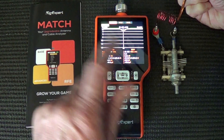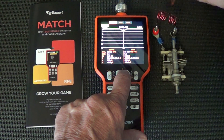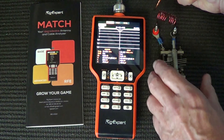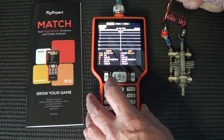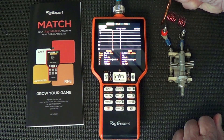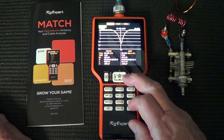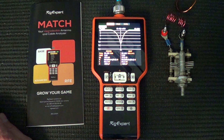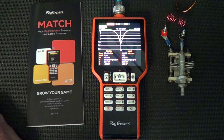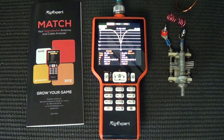Push the OK button — don't push that one because that'll go into repeat mode and writes on top of each other. Push the OK button and we'll see if we can get a good coupling. We've got a trace there, and we can see the best match is at 35.49 megahertz — that will be our resonant frequency.